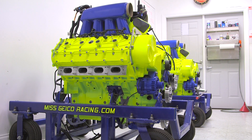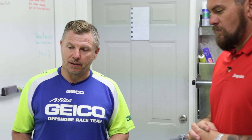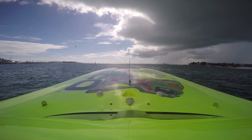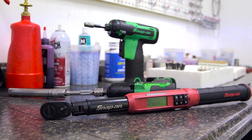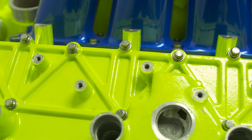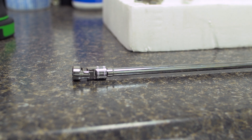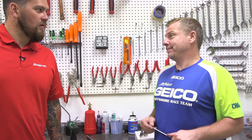It's a twin overhead cam V8. These don't have the exhaust and turbochargers on them right now — they're in the assembly process — but they end up with two turbochargers making close to 2,000 horsepower each, and there are two of them in the boat. We use very specific bolts on our engines, which makes it very difficult sometimes to get into tight places. The universal jointed quarter drive gets inside where the intakes bolt on; without this, that would be a two-hour job. Yesterday, putting four on took about 10 minutes.